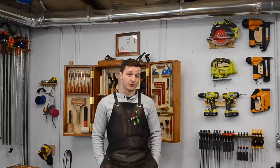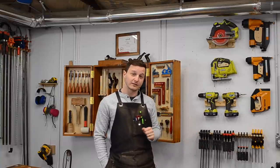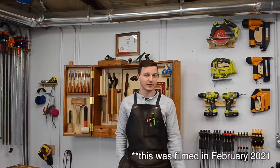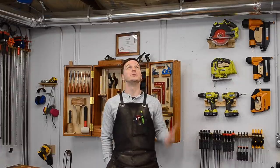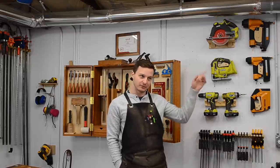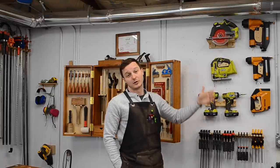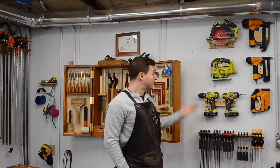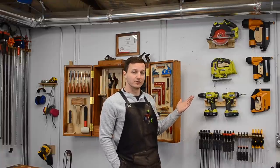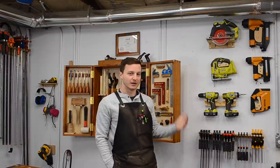When I first stepped foot into this garage, there were only studs, outer sheathing, no insulation, all sorts of holes to the outside, sunlight trickling in. It gets really cold — I'm outside of Chicago, and today it's about six degrees Fahrenheit. So I put insulation in the ceiling and walls, filled up all the gaps, added insulation on the garage door, and put up OSB sheathing. That was a decision between OSB, plywood, or drywall, and I'm really happy I went with OSB. It painted up nicely — it took about three coats of primer and paint to make it really bright white, which I like for filming.